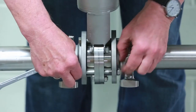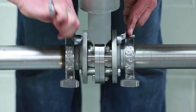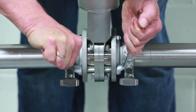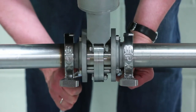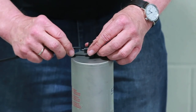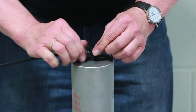On the SVS series, gently position and support the valve between the connection cover flanges. Line up the holes and install the bolts using a 13mm wrench to tighten equally in a cross pattern. Reconnect the pneumatic hose to the actuator or control unit and resupply electrical power if necessary.